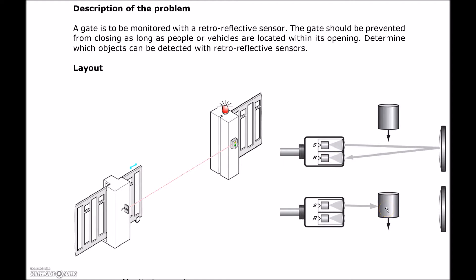If the object comes in front and blocks the light from getting to that reflector, then it doesn't matter that you have ambient light coming to the receiver. It's looking for that specific frequency and for the depolarization of the light. So once it doesn't see that, it trips off and sets the output of the actual sensor.